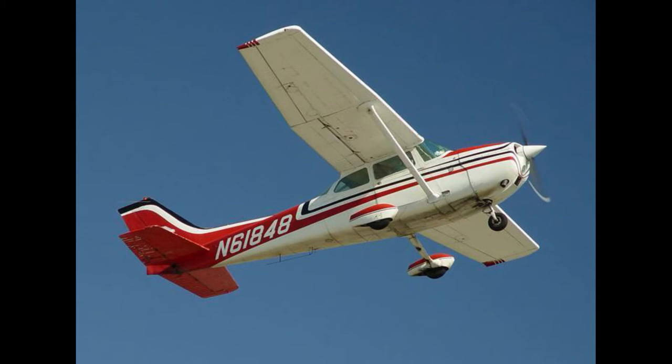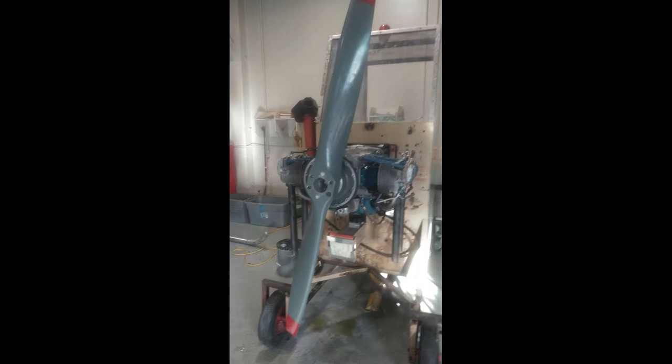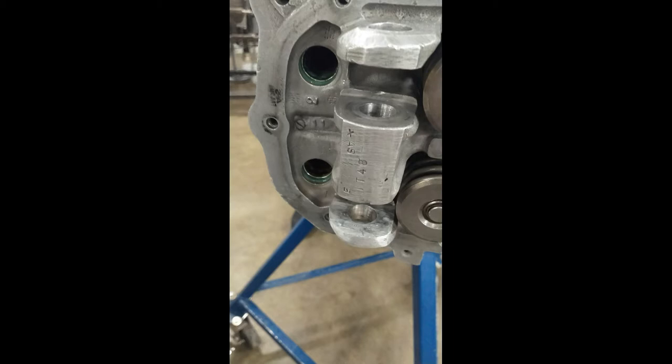152. The engine itself maybe produces about 100 to 125 horsepower, so I'm not sure about our engine, being how old it is, and all the antiquated devices in it, if it can still support that much horsepower. And by antiquated, I mean it's got a lot of old parts in it still. I bet it's losing compression in some places. We did run compression checks and they were fine. It was within tolerance, but I'm not sure that this engine can put out what it could before, when it first came out on the market.